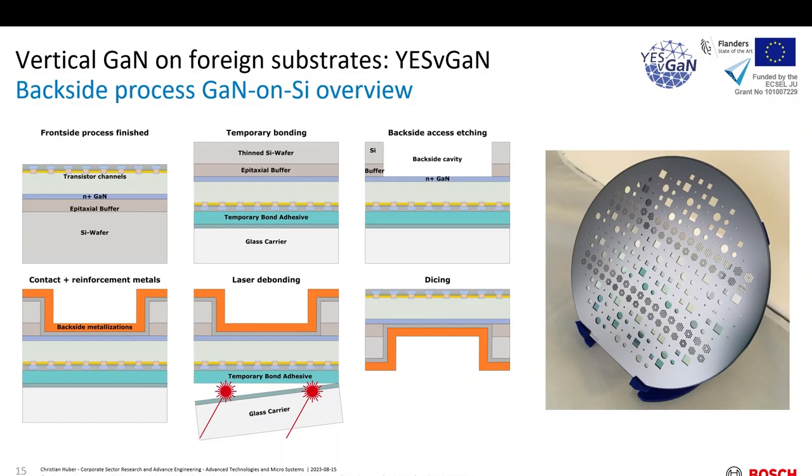As a demonstrator on the right-hand side, you can see a GaN-on-silicon wafer — actually a HEMT stack with a 4-micron thick GaN epitaxy — where we removed the silicon underneath areas of up to 5 mm diameter on a 150 mm wafer. It looks like a wafer with holes, because the wide bandgap material remaining in those holes is transparent. But this transparent something is nothing but a 4-micron thick epi layer — zero cracks over a 150 mm wafer. This demonstrates that this is not a neat university trick on a coupon, but is really feasible at full wafer level.